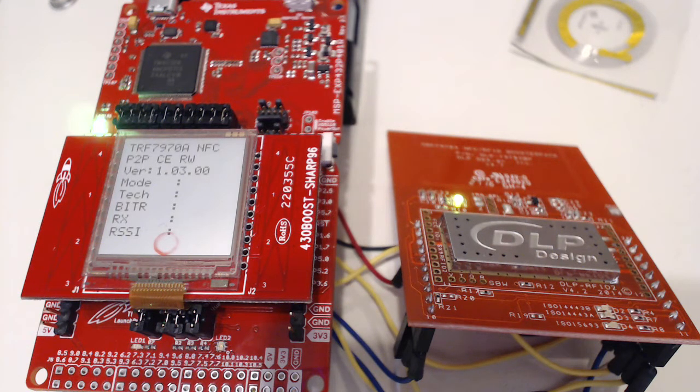What I have done is moved some pin assignments for the DLP — actually moved them to the inside row of pins on the headers, which you can't see because the Sharp booster pack is there. So I've reassigned some of the signals: the SPI select and some other signals, and went ahead and enabled those. That allowed me to use both of them on the same MSP432.